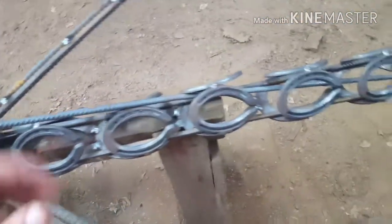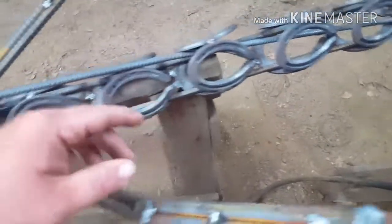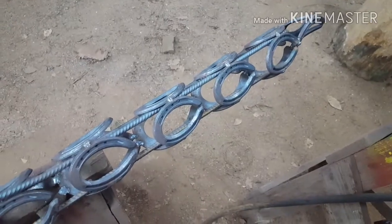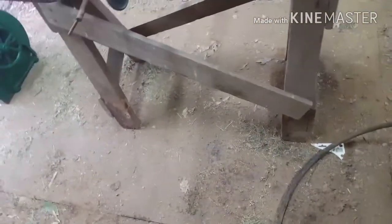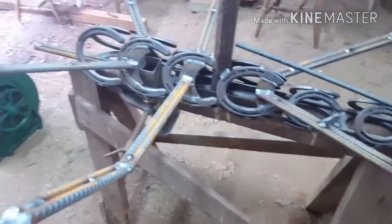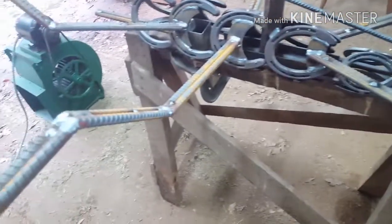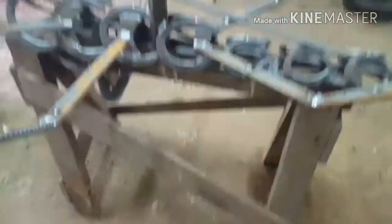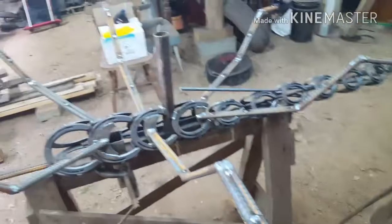I'm having to put all these supports in because the horseshoes just won't hold it on their own. The tail was flimsy — the whole body really — so I put pieces of rebar in and now it's real sturdy up top. The tail is still flimsy though, so I'm going to run one piece along the bottom of the tail and weld it on. Hopefully if kids are playing around it or messing with it, it won't bend much.